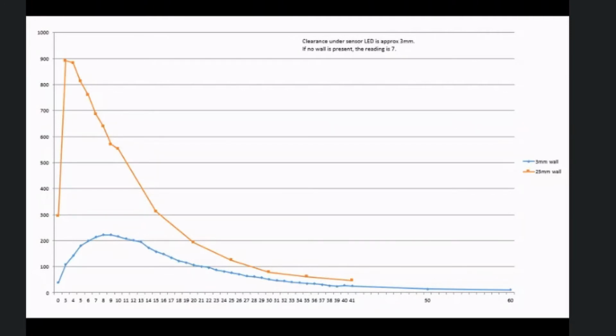You can detect walls out to over 50mm. So with a 40mm wide mouse rammed hard up against one wall, you can detect whether the other wall is present. I think it can work, but I would use line sensors for this kind of maze. Any questions about using a reflected light sensor? Deathly hush. Okay.